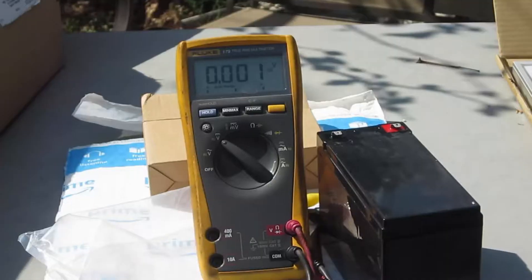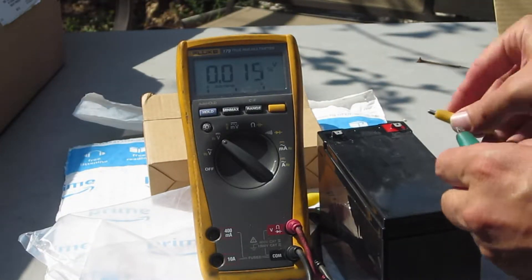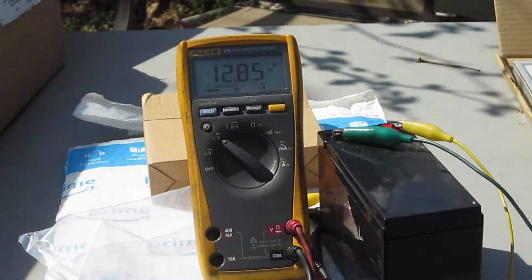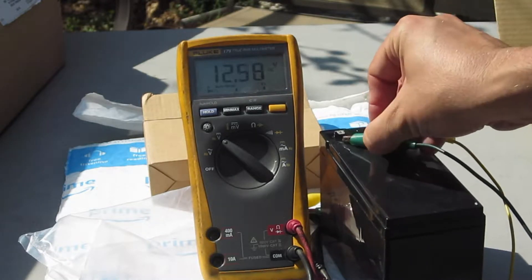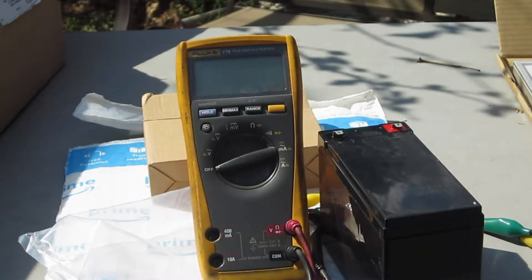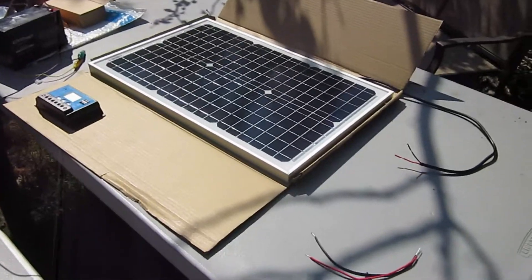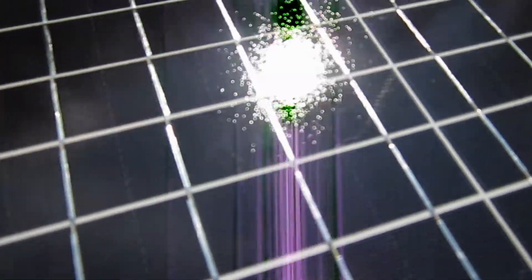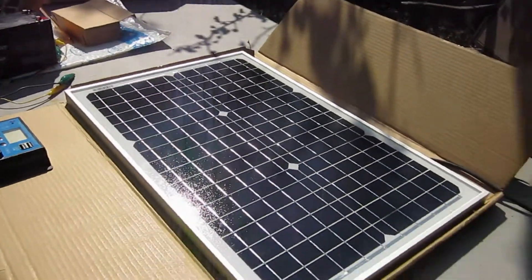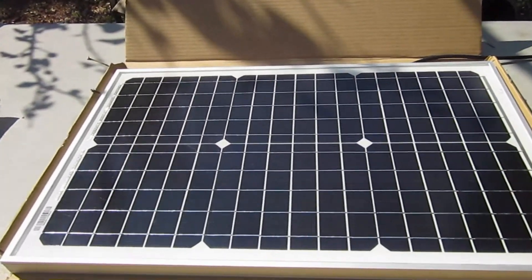While we're testing things, let's test the voltage of the battery as well. I have this hooked up on the voltage scale and it looks like it's about 12.8 volts — about what you'd expect from a lead-acid battery. Let's see if we can hook this up to our power modulator and charge the battery. Taking a closer look at the solar panel — it looks pretty solid, like it can stand to be out in the weather. It's got an aluminum frame and glass over the top. I think it looks pretty nice — we'll see how it holds up.